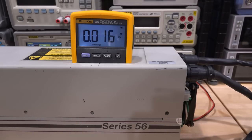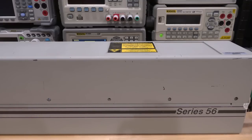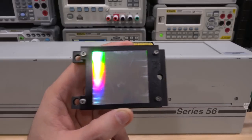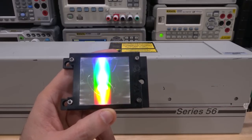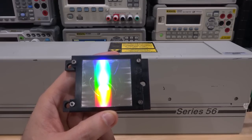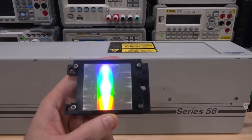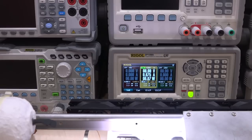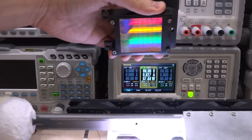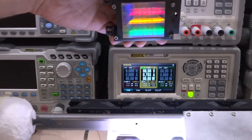The parameters look reasonable, so the health of the laser seems good. Now, how do we know the white light coming from the laser cavity isn't just any ordinary white light? We can quickly observe this before any spectral measurement. Looking at this diffraction grating, you can see the ceiling LED lights produce a really broad, continuous spectrum — no individual unique peaks, just combined white light. But if we do the same with the white laser-cavity light, look — very distinct, discrete colors reflecting off. That tells us the spectrum has very unique peaks according to the material the cavity is made of.